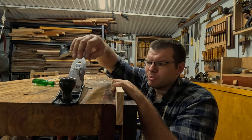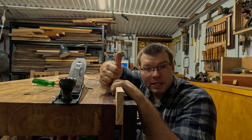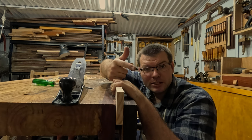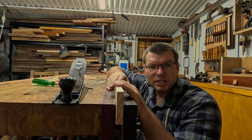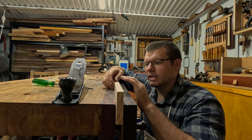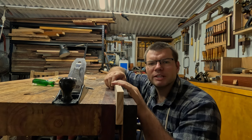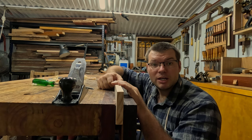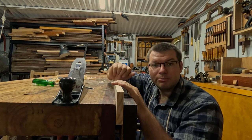So we can see just by replacing it with a modern chip breaker, we've already removed a lot of the backlash, we've made the blade less vibratory in the cut, and we're getting a much smoother cut - not getting anywhere near the amount of vibration through the blade which could be causing an uneven or less smooth shaving off your plane. So let's jump back up and I want to talk about one other change we can make to improve it a little bit further.